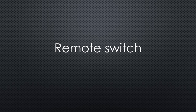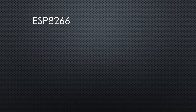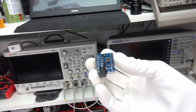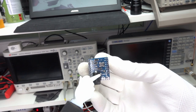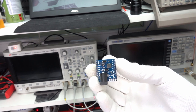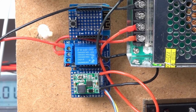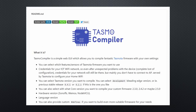The last component is the remote switch. I could have used a ready-made module, but this time I decided on the WEMOS shields. I added an ESP8266, a relay, and a prototype shield for the I2C connection to the temperature and humidity sensor. Initially I also used a power shield rated for 24V input, but unfortunately it did not survive — another example of not using two tightly specified Chinese modules. The WEMOS runs Tasmota, and because the HDC1080 sensor is not supported in any standard release, I had to create my own build. Using their tools it was not too complicated, but it has a learning curve.